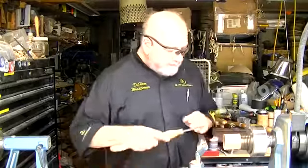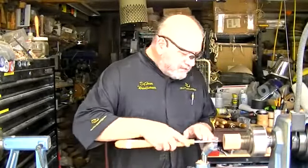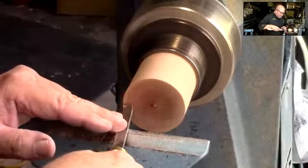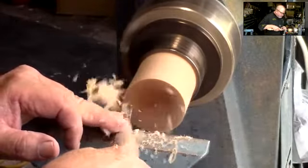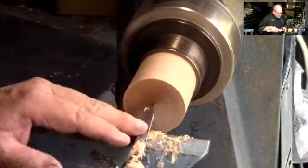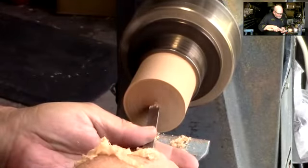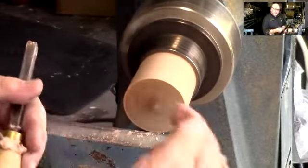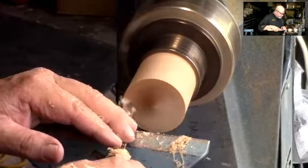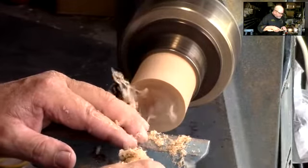Let me move that rest back so you can see what it looks like moving down into a box. Handle up, and I just glide across there with that radiused edge. At dead center, if you've got a little bit of a nub, come in, find center, handle a little higher, find the back of your piece, and just arc up. As soon as you come sideways again, you're going to cut a new little nub in the bottom. I use that radius to slice back and forth.